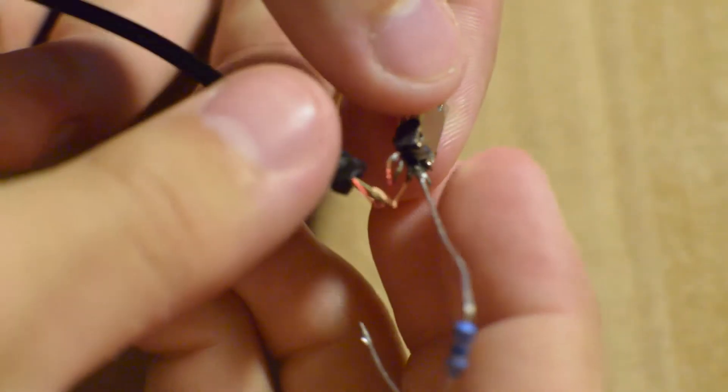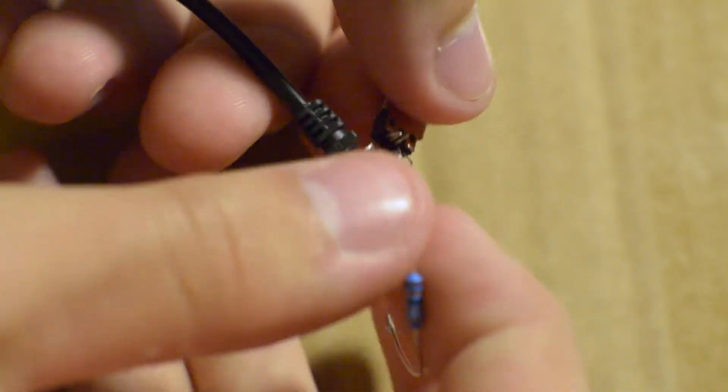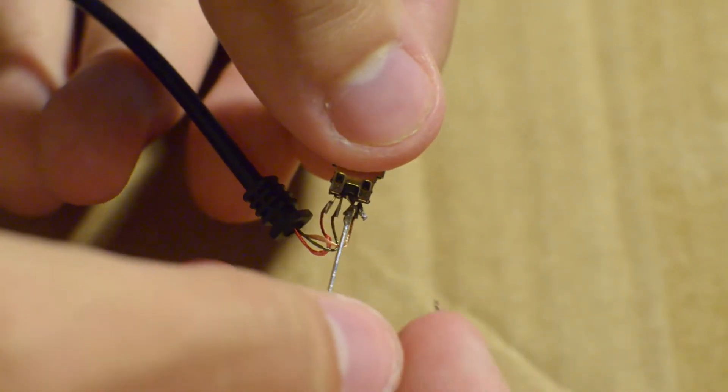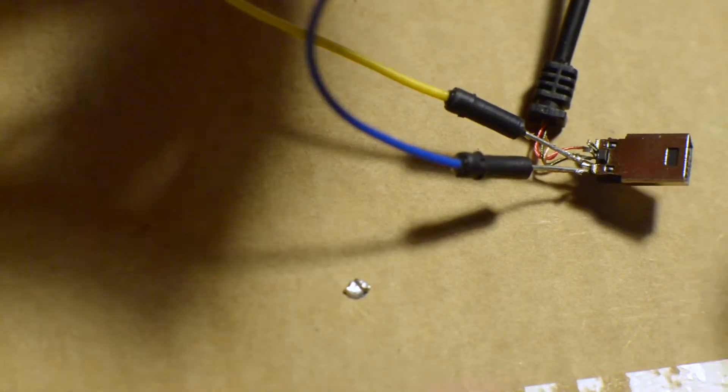I think this is how GoPro tried to disable cheap Chinese ripoffs. First I did a test run to see if this really works — I just soldered on a 330 kilo ohm resistor and it actually worked. Then I Frankenstein'd the whole thing so it looks decent.